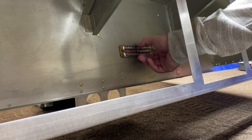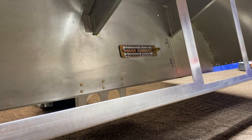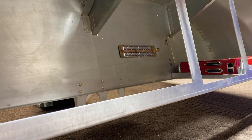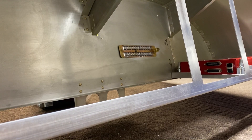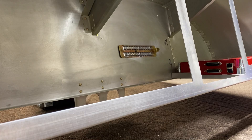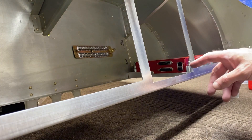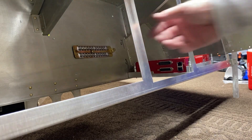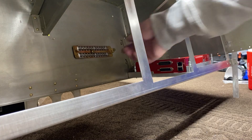I figure I'll put my ground bar here — that should work. Once I have that, this unit will go in here. I only now realized that this is sloped, so it'll be on a bit of a slope, but we'll see how that works out. Otherwise I'd have to make some offsets to level it out. This guy — once he's riveted on, there'll be good grounding to the rest of the plane. If not, I can obviously run a wire to it.